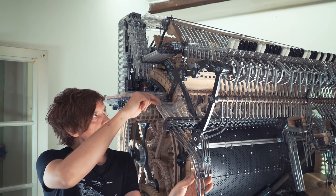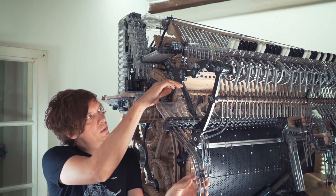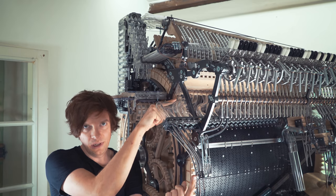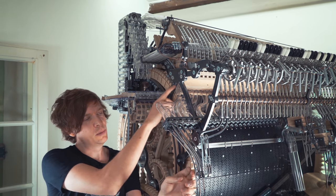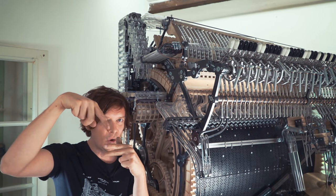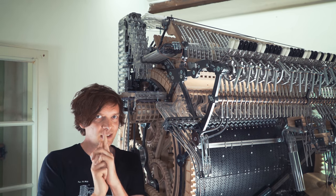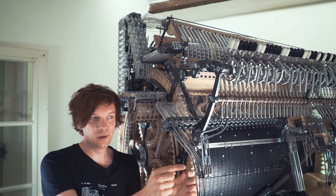And the higher up in this system we put the marble gate, the marble will be held higher up. And when this is closed, the marble will have a longer distance to travel, which means the higher up we put the marble gate, the slower the Marble Machine X can repeat the same note. This makes quite a big difference. So enter solution number two, the around the back.